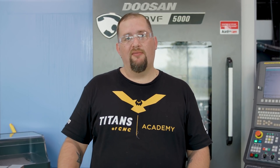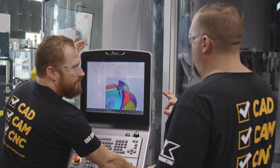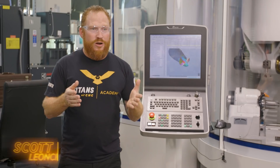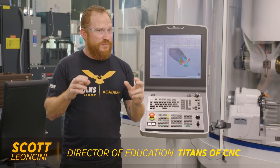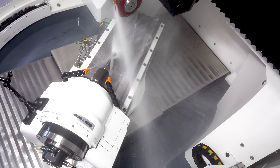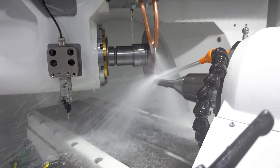We have an awesome grinding department here and they're able to make us a custom tool, so I'm going to talk to Scott and ask him if he can make us a nice lollipop cutter that'll really get the job done. We did some peel grinding on a solid carbide blank and preformed a spherical, or lollipop, end mill. Part of being a profitable and efficient machine shop is making sure that you eliminate all of the handwork possible.